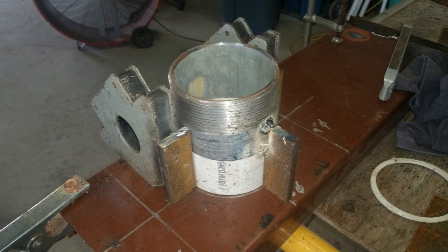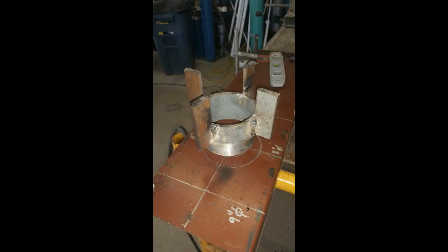A nipple — a 4-inch diameter pipe — is cut to be 2⅛ inches long. The nipple is then centered on the template and the first wing of the bit is placed and welded such that it sticks below the bottom of the nipple's unthreaded end for a length of 2⅛ inches. One should use a spacer under the nipple to maintain the correct tooth or wing exposure. All four blanks are then welded to the 4-inch pipe and everything is aligned.